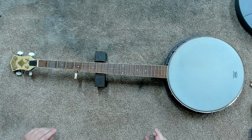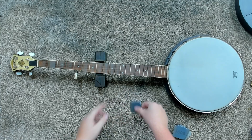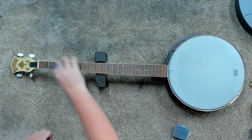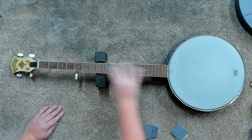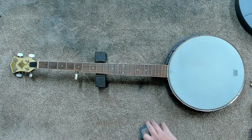That's probably good for the 1200. I'll grab the micro polishing pads and start going through those. I go through the micro polishing pads on the frets. That cleans the frets up real good.